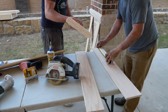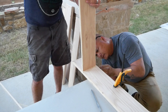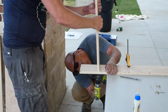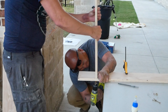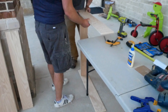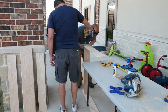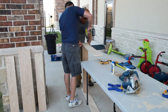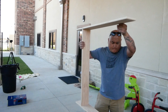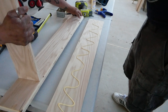And here are all the pieces of the table all finished. This is where the guys are going to start building the base of the table. We're going to do something similar to what we did with the top of the table — we attach two pieces of wood — except we're waiting to do that on the legs because that way we can screw the shelf in and then hide the screws by attaching the outer half after the fact. Once the shelf is secured to both of the legs, we're going to glue and screw the outer half onto the inner half, and that way we don't even see the screws at all, which is pretty cool. You'll want a generous amount of wood glue to stick these two pieces together. Don't worry if it squishes out a little bit — it wipes up pretty easily.